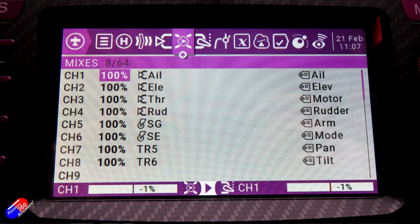So there we are — it isn't tricky at all. What you need to do is connect your head tracker to your radio and make sure you have the TR or trainer input selected. If you're not sure which channel it's on, try them one after the other and you'll find them. They're usually on channels five, six, and seven on most head trackers, to stay away from the first four channels in case your radio isn't as smart as OpenTX. Very early versions of OpenTX needed the trainer function turned on, but it isn't like that now — it's really elegant. Hopefully that answers the question. If you're interested in head trackers, that's how you set them up in OpenTX and specifically on a TX16S.